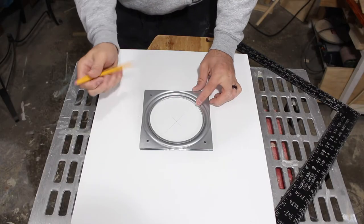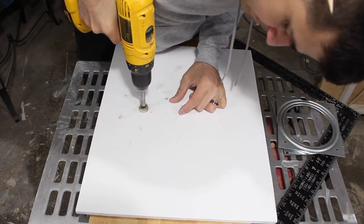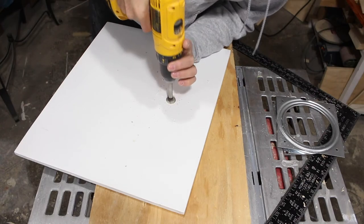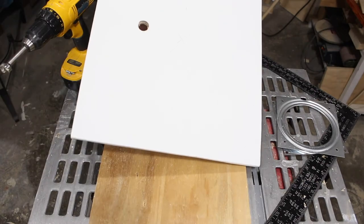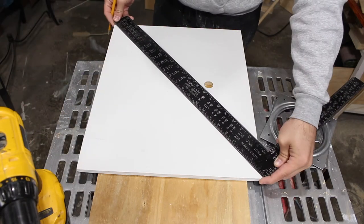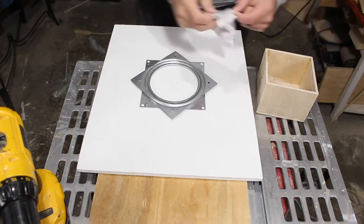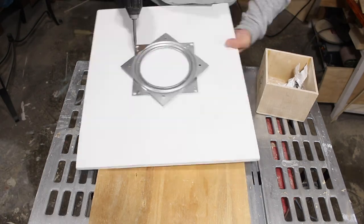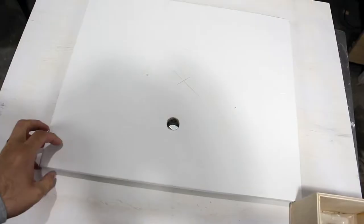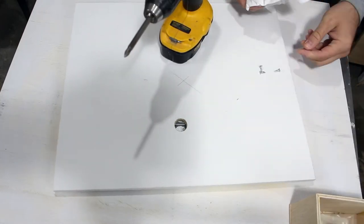This is really interesting to me. I looked up some different ways of doing this, so here I am drilling a hole where the screw will be and I pop out that little piece there. Marking for center here. Now after I screw the Lazy Susan hardware, you can see that hole lines up with the hole on the underside so that I can screw it into that other piece.